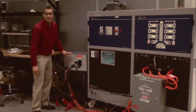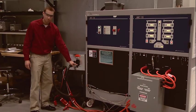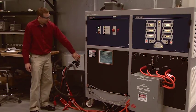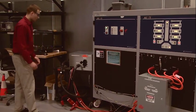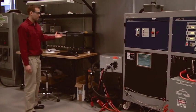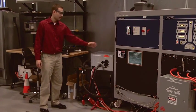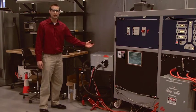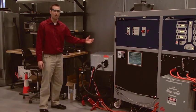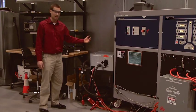Channel B is the PEV inlet — again the SAE combo connector inlet — with DC power on the two extended pins, proximity, ground, and pilot connections. Over here is the monitor I'm using. Within this enclosure are the two communication controllers: an SECC and an EVCC. During the whole communication session process, the electric vehicle always sends requests and the supply equipment communication controller responds to those requests.